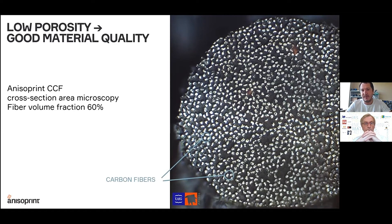This is the reinforcing fiber we use for the co-extrusion process — shown here in cross-section. You can see it's a round-shaped pre-preg material with a very high fiber volume fraction, very good impregnation quality, good distribution of microfilaments inside the pre-preg, very low porosity, and very good adhesion. This approach gives us both the benefits of the pre-preg and the co-extrusion approach: the preliminary impregnated fiber gives very good material quality, and co-extrusion processing provides all the flexibility of co-extrusion type processes.